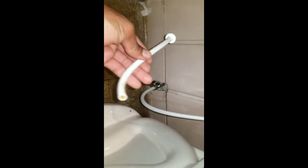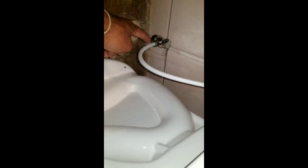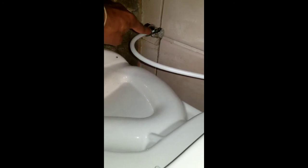and getting a proper line. For some reason they don't provide one in the box, but like I said, you can go to Home Depot and just buy this piece, and it comes with a washer, and it would look like this, much longer with a washer on it. Then you just cut it to the proper size that you want. You attach it here, run it down to here, see how much you need. Then you put on this first, then this next, then the washer on the outside, and you stick this into the neck as far as possible. Then you tighten up on here, and it crimps everything together and holds it.